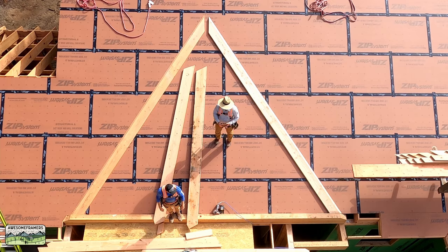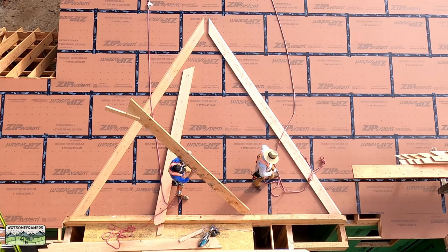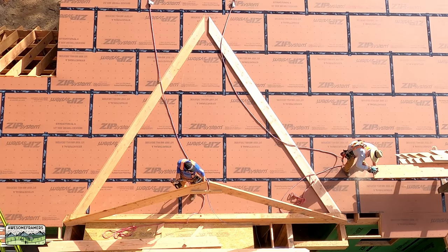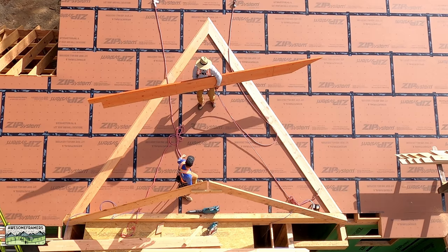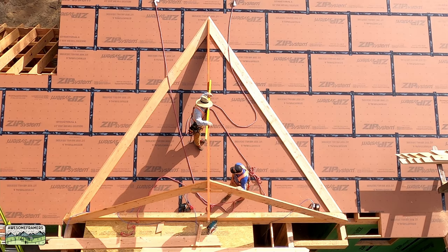Now the moment of truth: you can do all the cutting and math, but there is an order of assembly. First, get those big heavy sleepers down on the ground and tack them down toward the beam, butt them tight, and tack them at the top. I measured down the plumb cuts on the rafters and nailed a 2x4 to hold the LVL ridge — it's heavy, so it's just a helper. Kyle lines up the top, I bring over the LVL ridge, and once it's in we check for level. I ended up cutting an inch off those sleepers to slide it downhill.